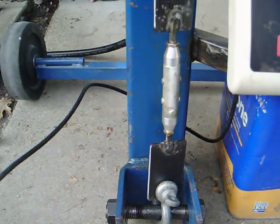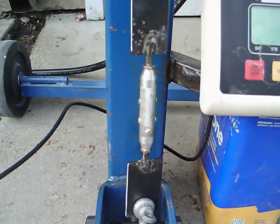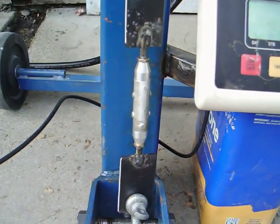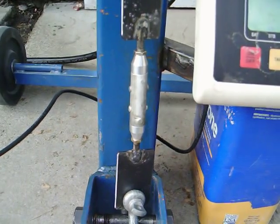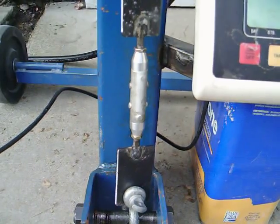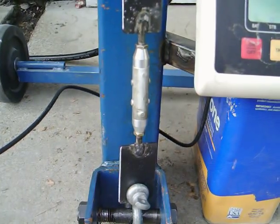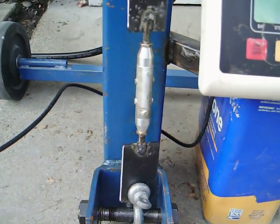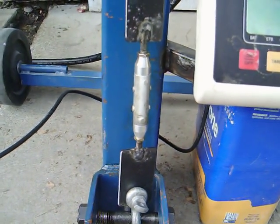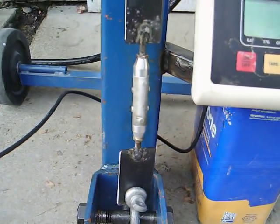Let's get you a little close-up of that. Since it's a tensile example, the length of our test sample really doesn't matter all that much. What is important is that I've constructed this test sample absolutely as casually as I could, using grotty corroded tubing and hand-hammered rivets installed with a framing hammer, and I also kept the edge clearances slightly below the minimum stated — just to make this thing as casually assembled as possible so we get an example of the breaking strength of the weakest built one we could.